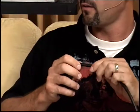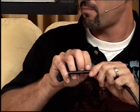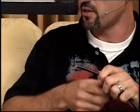Wire management, we're going to get into cable stripping. Now, I've got this one here. This is a nice tool that I wish I would have had years ago. I actually still don't have one of these personally, but we'll find a way to get one. Sorry, camera guy, I'm over here flinging it around, but these are cable strippers. If you're familiar with working with wiring up anything, typically I've always used a razor blade or a sharp pocket knife, and tried to run a line down the outer insulation and strip it back.